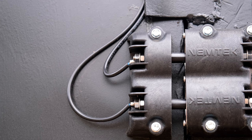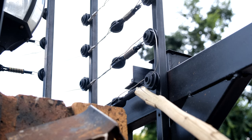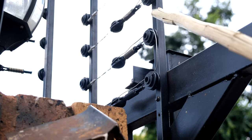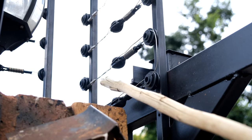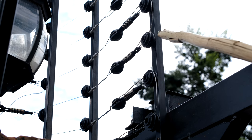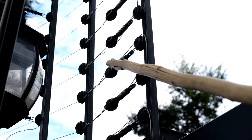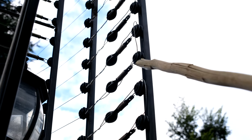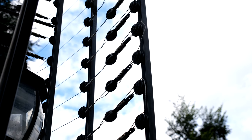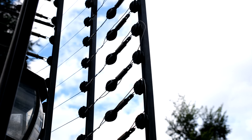On the other side of the gate, here is the very first wire coming from the contactor running along the gate. You can see it's jumpered to line 2. Then line 2 runs along the gate, jumpered on the other side, and returns on line 3. There you can see it returns on line 3, then jumpered to line 4, running along the gate and returns on line 5. Then 5 is jumpered to line 6, running along and returns on line 7. You follow that all the way until you get to the final lines.